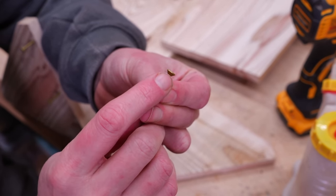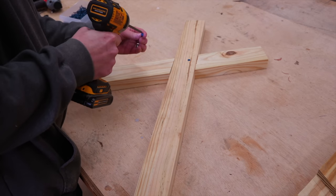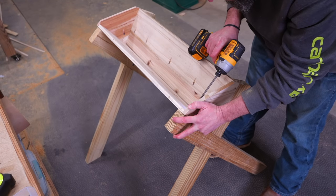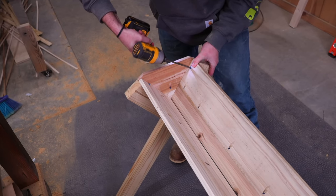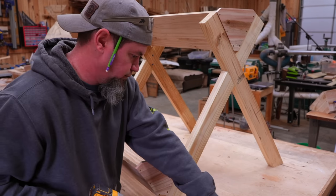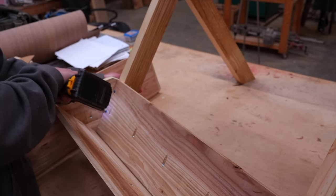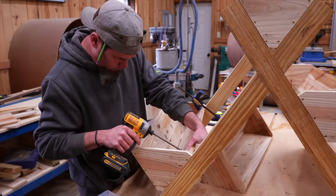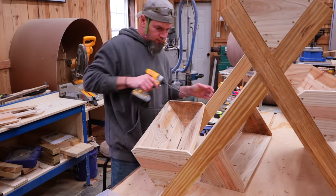With all of our boxes made, let's put this thing together. With our legs interlocked, I'm going to put a couple of one and a quarter inch screws in place. I chose not to use wood glue here so I could easily take this apart to store for winter. I'll start by attaching the top box first, bringing the edges of my top boxes out to match the edges of my legs. Then I'm marking my legs for the other two boxes at 11 inches up and 23 inches up. I'll install the bottom box next to make sure everything is square, lining the top edge up with the 11 inch mark. Then I'll repeat for the center box, lining the top edge with the 23 inch mark, flip it around and do the same for the other side. That clamp is basically acting as a second set of hands.